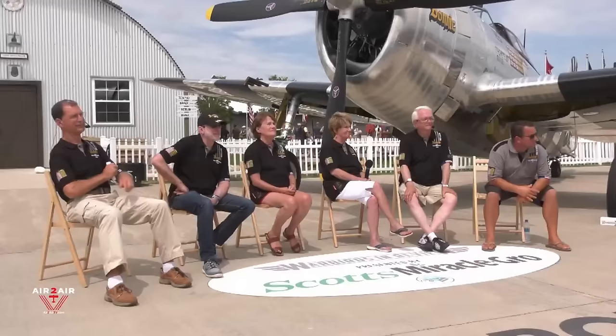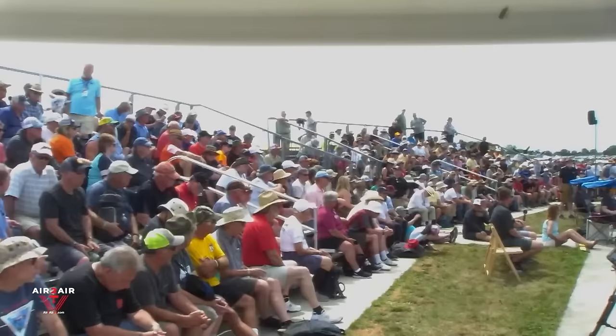What are you burning for fuel in this one now? 100 low lead. Do you have to derate the engine for that? Yeah, we don't run rated takeoff power anymore. It would be 51 inches dry. We use 45. What were they using during the war? What was the octane? 115, 145. Okay. All right, another question.